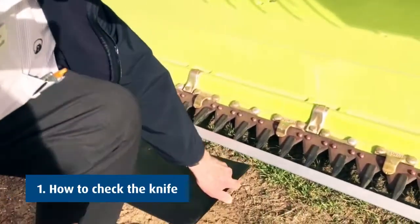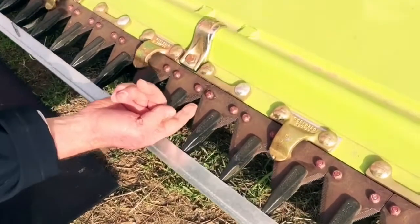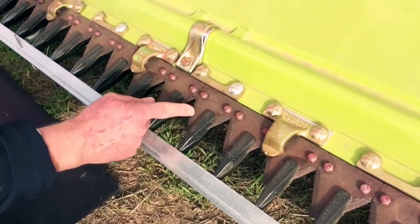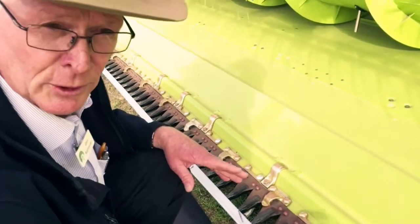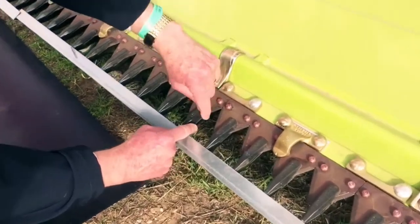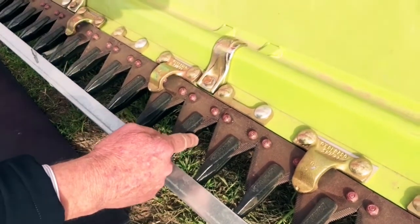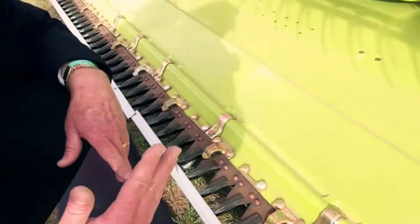Obviously a couple of things we need to look at. Firstly, the knife needs to be set correctly. If we look down here at the knife, the knife section should be really sharp — when you rub your finger along there it should be prickly. That's a good knife section. If it doesn't catch your finger like that, it's best to replace it, because in a short crop you need to cut it neatly. It can be torn off with a taller crop, but with a short crop it's got to be cut neatly. It's also got to be resting on the bottom of that ledger plate, cutting like a pair of scissors onto that base ledger plate. That ledger plate should be sharp as well — on worn fronts it can be a little bit rounded, and it's best to touch it up with an angle grinder.